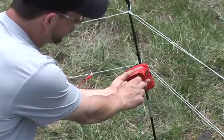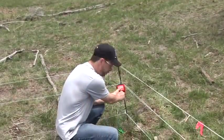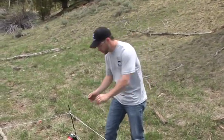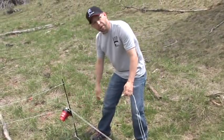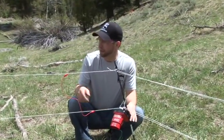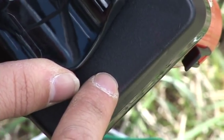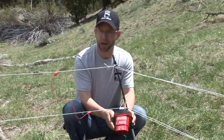There's a switch on the bottom of the energizer and our fence is now turned on. To get out of your fence, turn it off first. You can either step over it, but if you're carrying heavy equipment you can use the gate hooks to take your fence down and step into your fence more easily. Once on the outside, turn the fence on. You can see the red flashing light inside blinking about once every second, which means the energizer is working properly and sending out pulses.